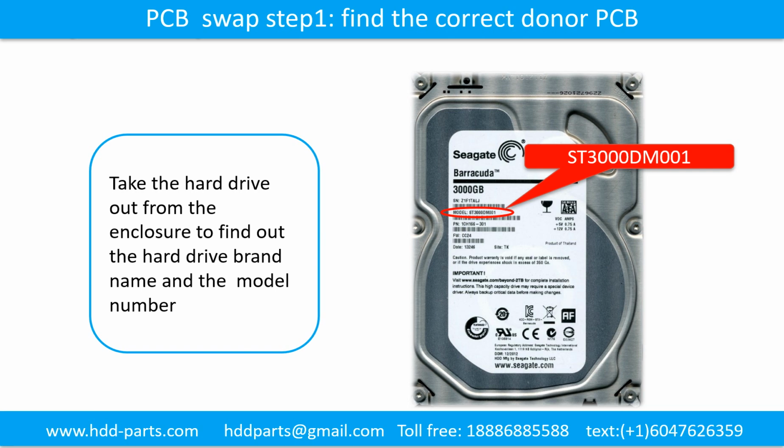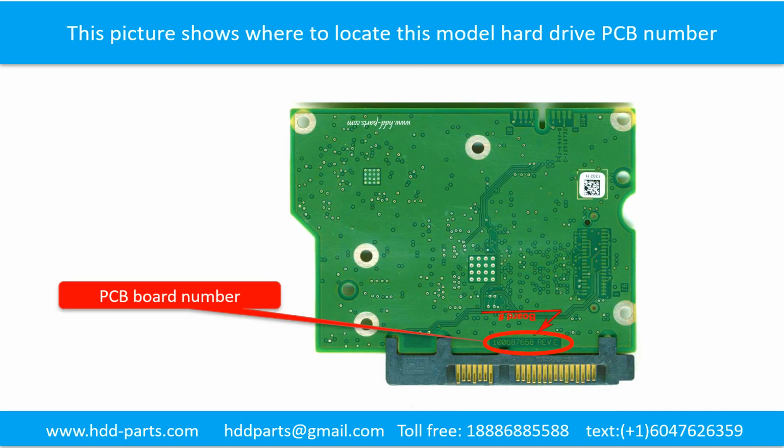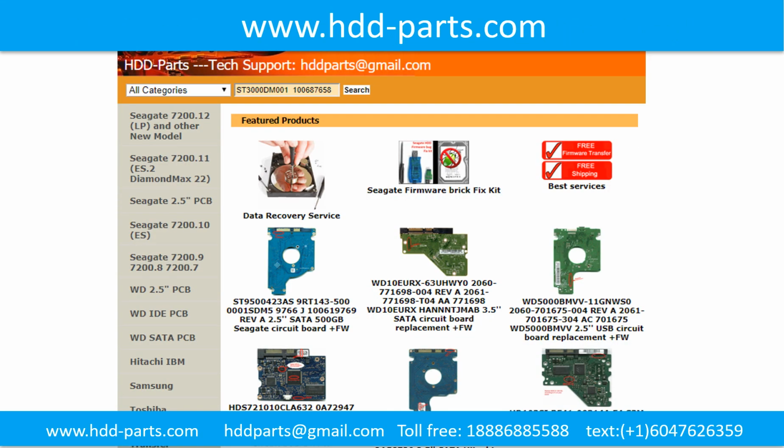Locate the hard drive model number on the front of the hard drive label. Locate the hard drive PCB board number. Different brand names have different PCB boards, and the PCB board numbers are different. You may go to hddparts.com to check out other brand name PCB board numbers. We use the hard drive model number, PCB board number, PCB board sticker number and CPU number as reference to search for the donor PCB board.